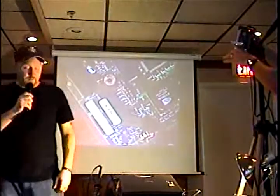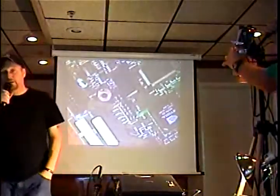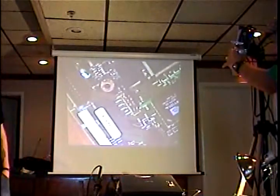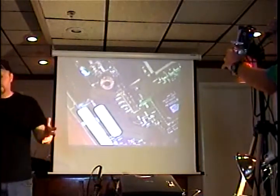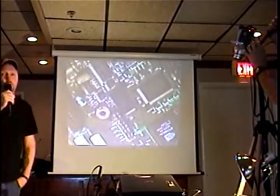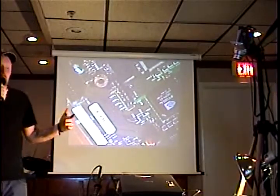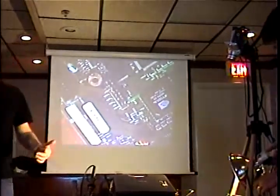I know it's hard to see. It's marked on the Xbox board as R7D3. There's two small pads of solder, and afterwards, if you want to come up and take a look at any of these, feel free to. I'll point them out to you. But the one on the top of the 1.0 and 1.1, actually the one on the top of all of them, one of them is R7D3.